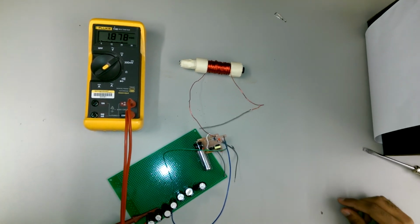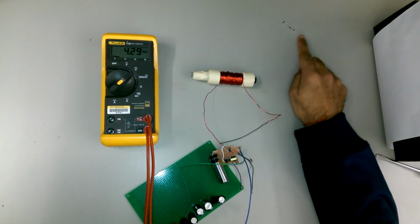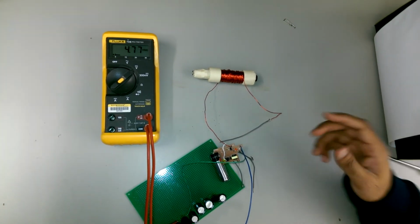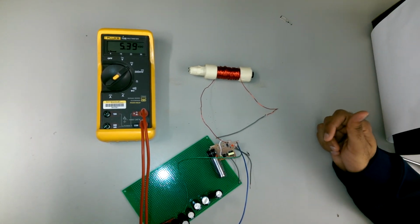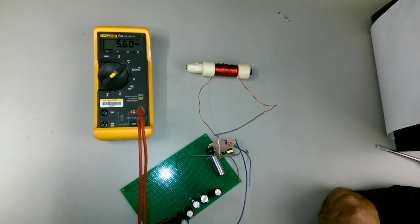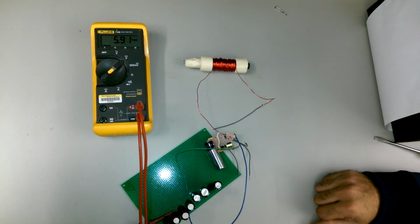Wow. Looks like the coil gun was pretty powerful. We can see the projectile go here. We can increase this velocity if we increase the number of turns in our coil, or if we increase the number of capacitors on board. So yay, we have a working coil gun.